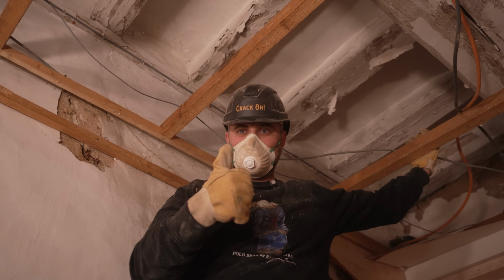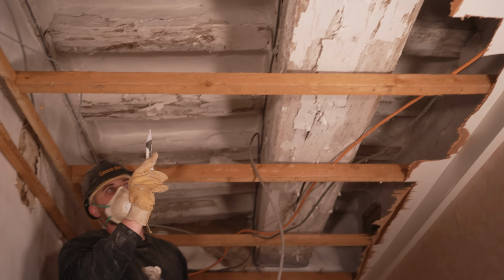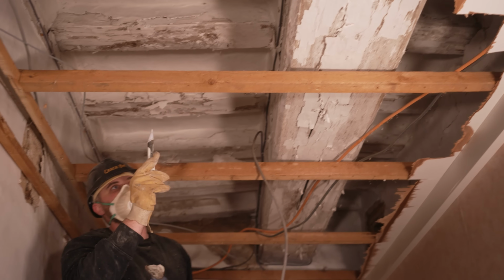Hmm, good job. No, it's not live. That's the light. We know that's live. No, they're not live. They refeed back. Orange is generally not necessarily fire alarm, but it could be the emergency lighting because it's multi-core. That's just normal electric cable. No earth, which is a bit dodgy. But yeah, that's not live. We know that light's live though, so it's fine.